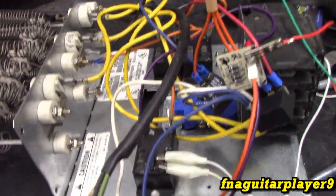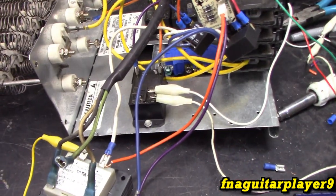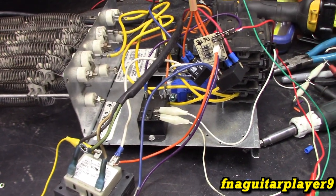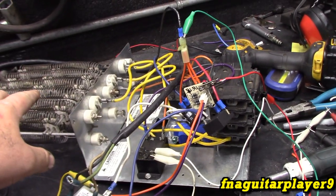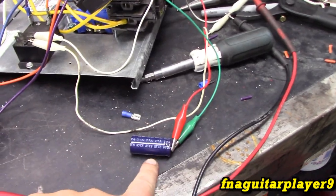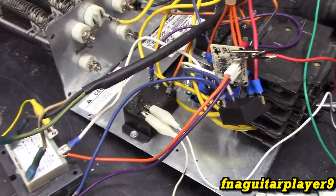all three relays come on. If you hear the beeping, it represents the blower being on. So listen when I unplug it. Unplug. So as soon as I unplugged it, the other two went off. They'll be controlling the elements, and this stayed on for approximately 4 seconds until the capacitor drained off. So that's how I'm going to set this up. I think it'll work perfect.